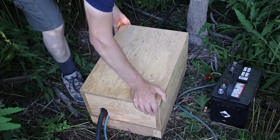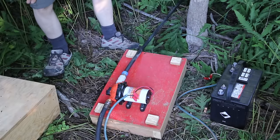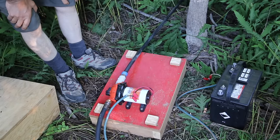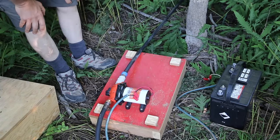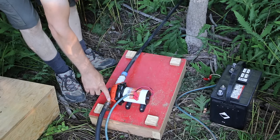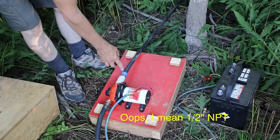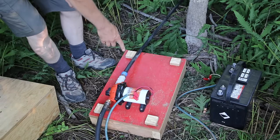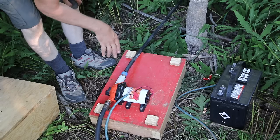This is the box I built just to cover up my pump. It's a Seaflow pump — it pumps 5.5 gallons per minute. The fittings are 1-inch national pipe thread, but on the suction side I put a 3/4-inch line because I have about 20 feet of line here.